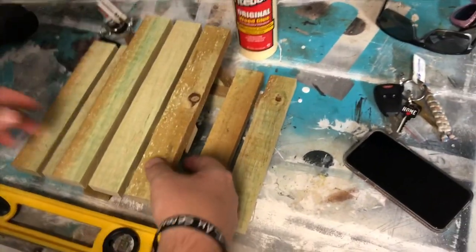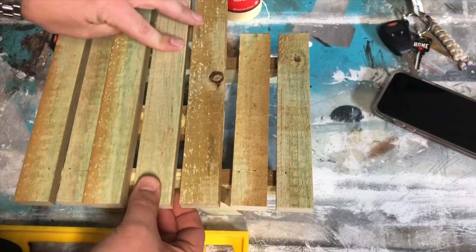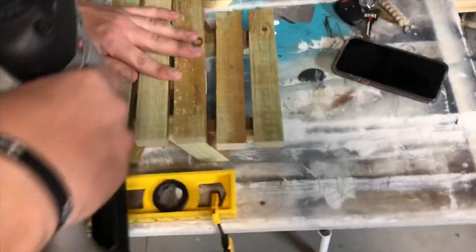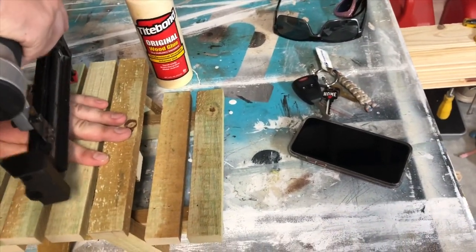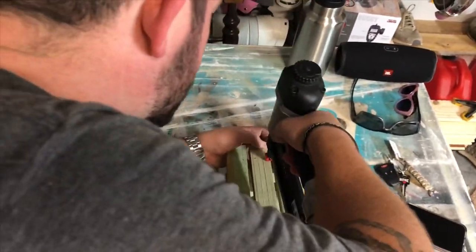So what you do is you get it where you want it, finger width, but a fingertip underneath, fingertip this way. Make sure you're gonna be the same. If you want, you can measure this, but again, I've built enough of these to where I don't have to worry about that. On the edge, it's gonna go into the long part of the wood. So on the edge right here, that's where you're gonna drive your 1¾ brad nails. Same thing on the edge of that wood, and on the edge of that one. That way you don't have to worry about them blowing out on the bottoms, because again, you live and learn, been there, done that. I switch back to my 1-inch 18 gauge brad nails. I then sink two right into the corners of that piece of wood. Make sure your gaps look good and sink it there.